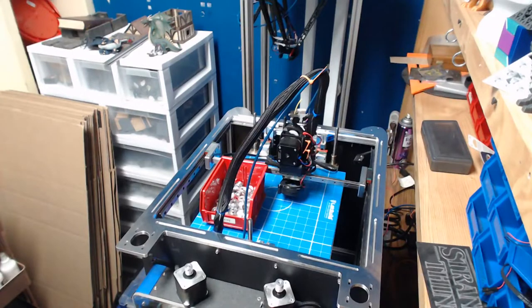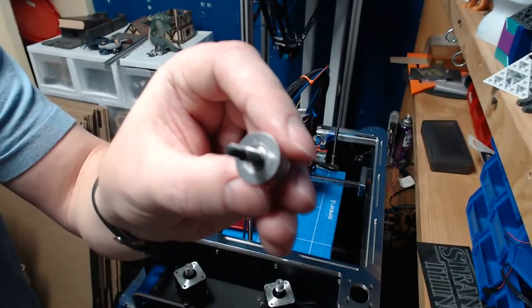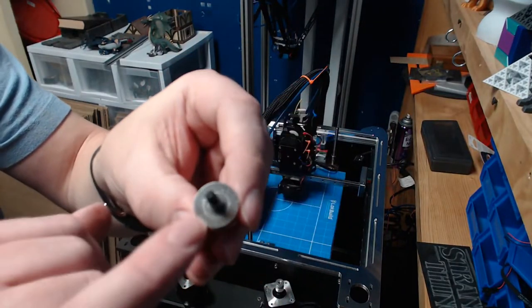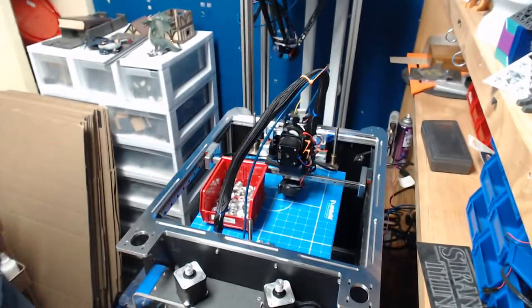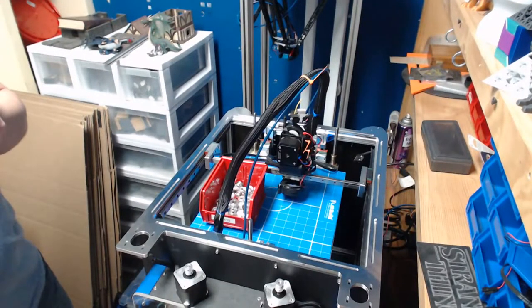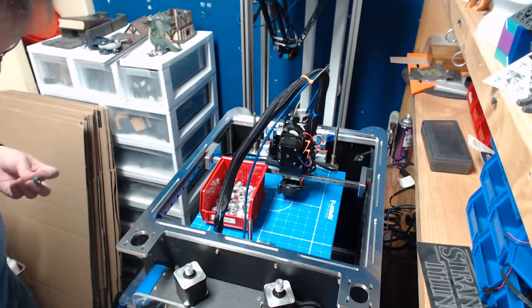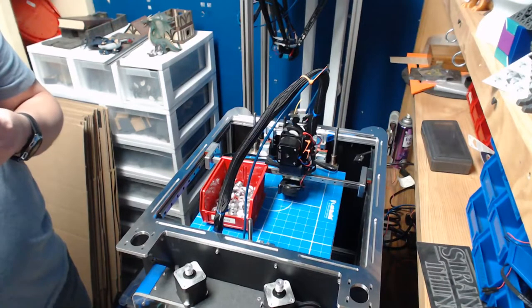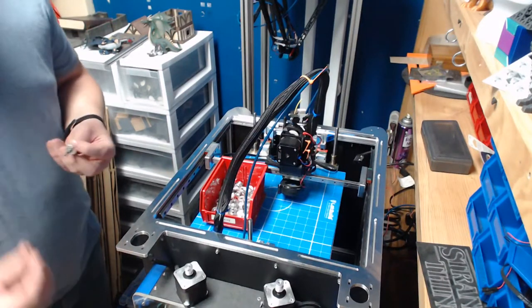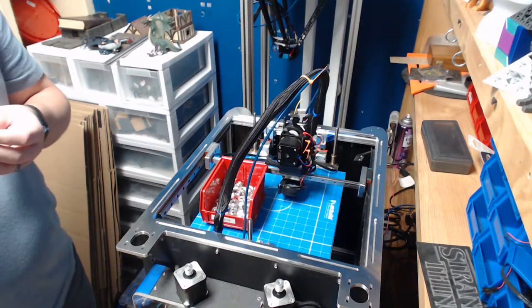See, and right there is why I hate these. I wish I could show this in detail on here. I'm putting this shim on, and that bearing totally sunk inside of this cheap idler. So I'm going to have to waste a shim to make up for the bearing height, which is why in our documentation I can't say use exactly 5 shims or 1 washer and 2 shims to make up the space, because every darn idler is a different height. Drives me insane.